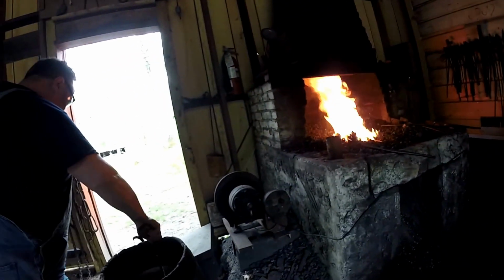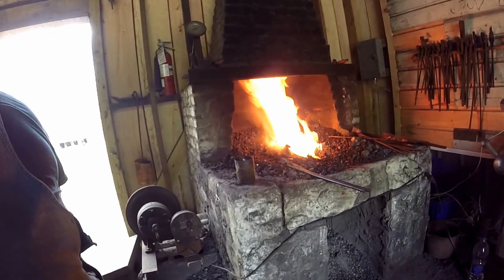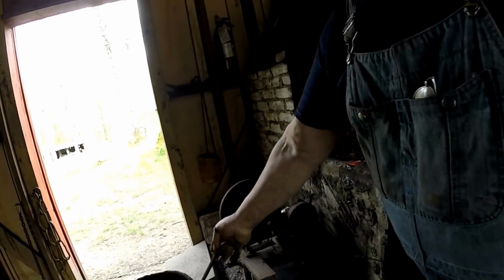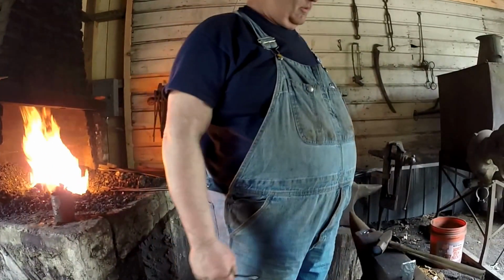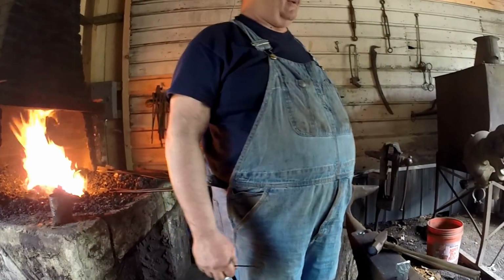Going to wet the edge into the fire. The fire's too big. Never wet the middle of the fire because you can crack the fire pot. It's cast iron. It doesn't have to be too hot to cut it, because you're hitting downward.